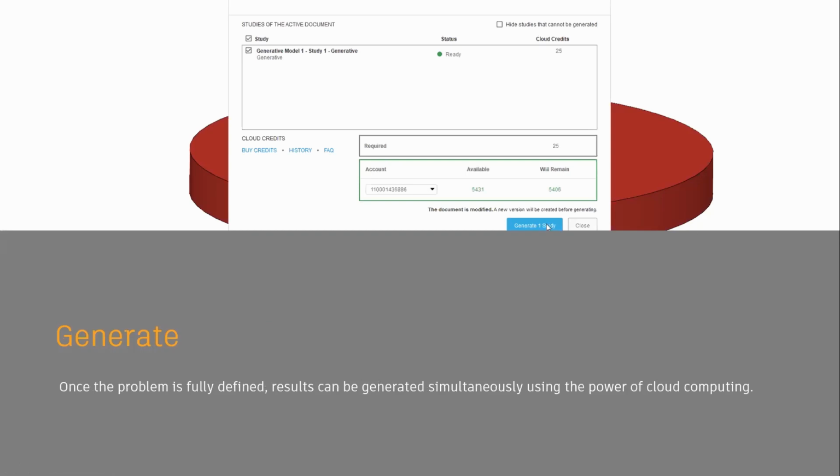Once you've set all this up, it's quite a lot of calculations. Fusion will do a calculation for every material provided, for every manufacturing method defined, and it will do so iteratively. So for each one of these, it has to do at least between 25 and 150 different iterations to come to a usable result. And for this reason, we do not run these on your local machine. That would take donkey's years. I mean, quite literally, you'd be looking at days worth of calculation time.